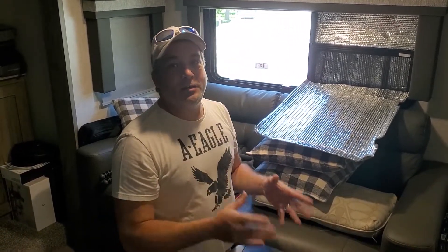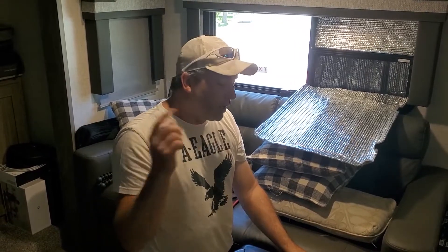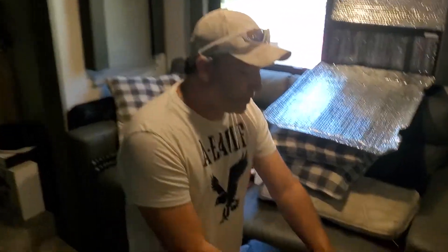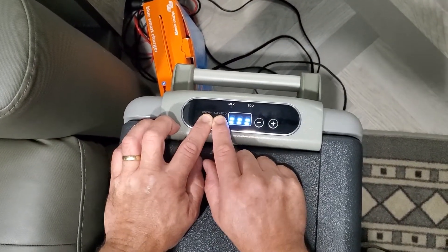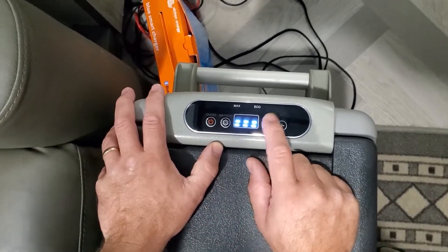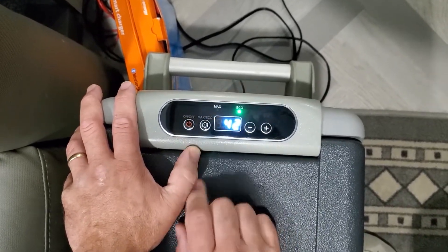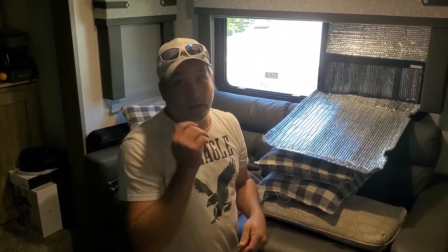As you've seen, it ended around seven days, but the battery level protection on the unit itself was on the highest level. We're going to step it down to the next level and see how much longer we can get, then maybe down to the final level as well. On this cooler, you just press these two buttons — it's already on level two, so we're going to go down to level one, hit the power button, and there she goes again. Plus, remember the battery has its own low voltage protection, so we'll see what shuts off first.